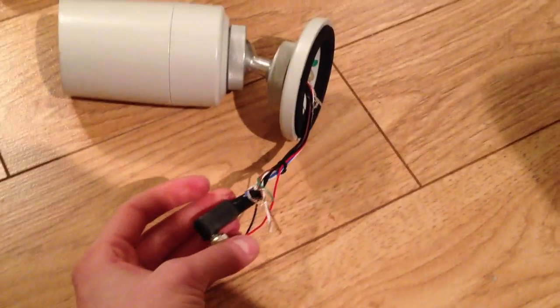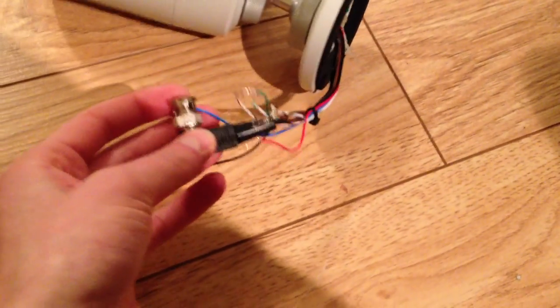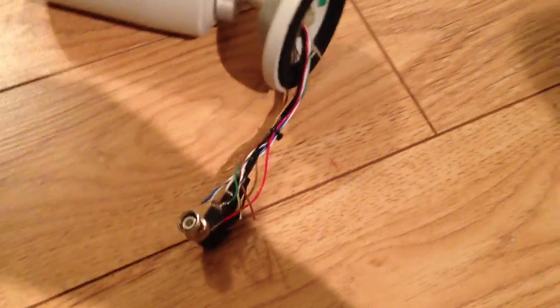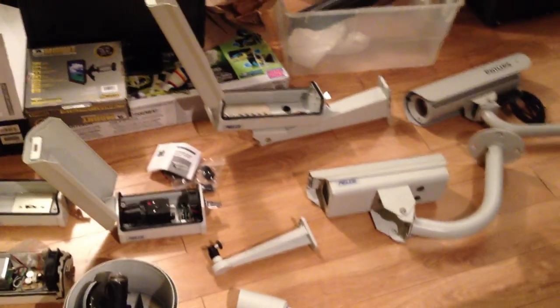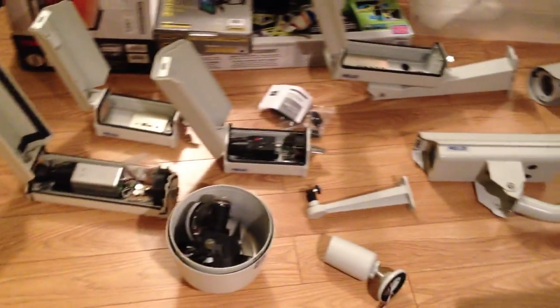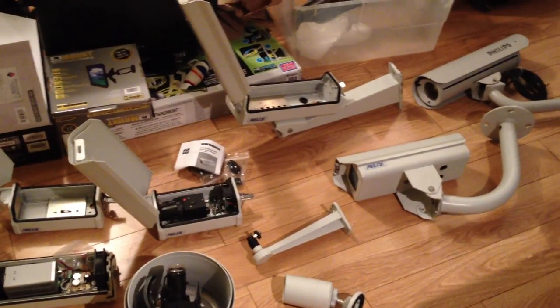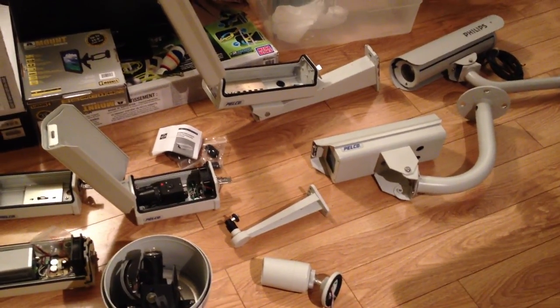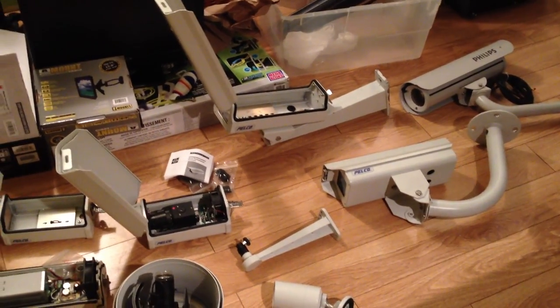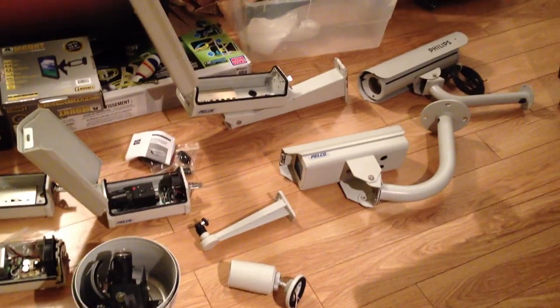This is a day/night camera — I've actually repaired this one because when I got it, whoever uninstalled it had cut the whole wire. I had to find the connections and get a new BNC connector and solder it all in, but it works just fine now. So that's about it — I hope you got some information and got to see these enclosures up close. If you have any questions, comments, or need help picking something out or setting something up with any CCTV-related equipment, you can contact me through the Facebook page linked below. Take care, enjoy, and thank you for watching.